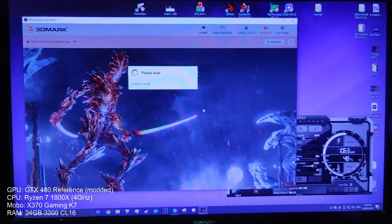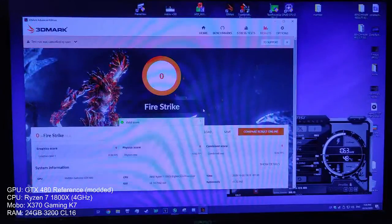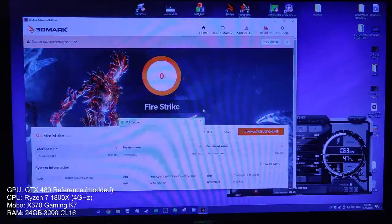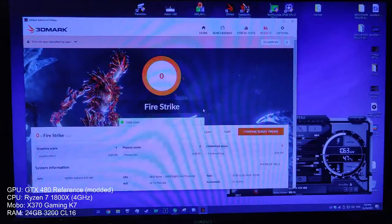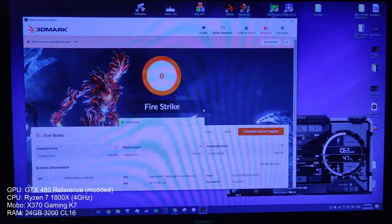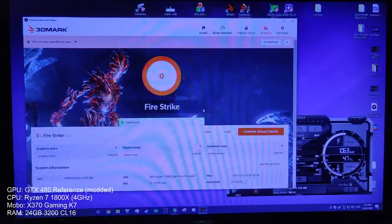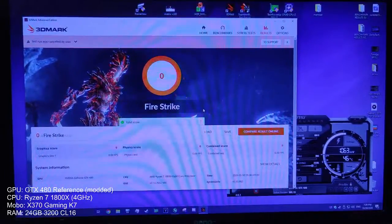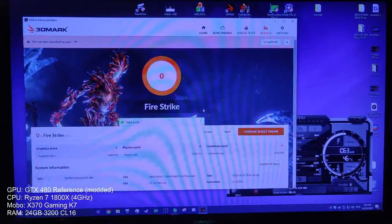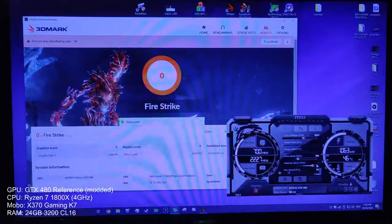Sometimes your memory doesn't like to be overvolted. Sometimes the memory is just really upset about getting more voltage. But I only saw that on Hynix, not on Samsung. But this is very early Samsung stuff. Though on the 460 the memory took it. Like on the 460 the memory did run.